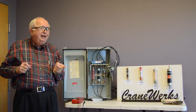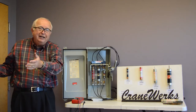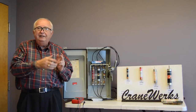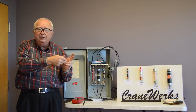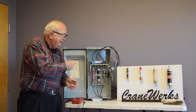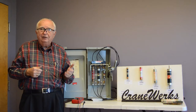That screws a lot of people up because they didn't go back in with a voltmeter. They'll throw a fuse in and say, oh, we're fixed. You turn it on. Well, you're still single phasing everything. And that single phasing makes this stuff get hot again. Remember, on a motor, and let's make the numbers easy, a 10 amp motor, if it's already at full load pulling 10 amps and you lose one phase, the remaining two phases go up to 17 amps. So 17 amps on a small fuse, it may take minutes before you actually lose the fuse. Hopefully your overload will take you out, because they're supposed to be acting faster as far as the motor current.